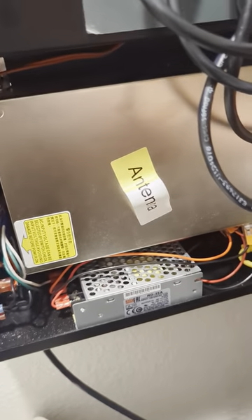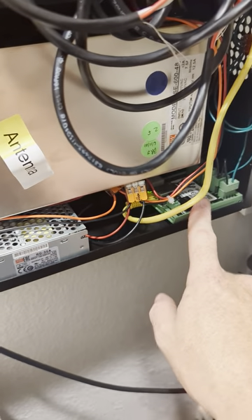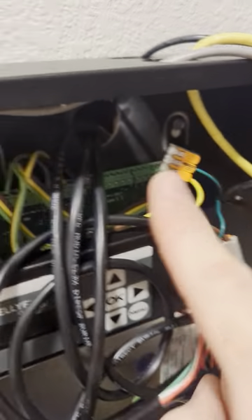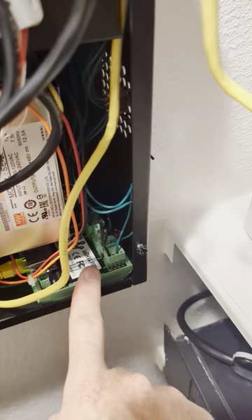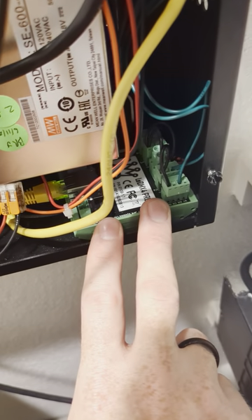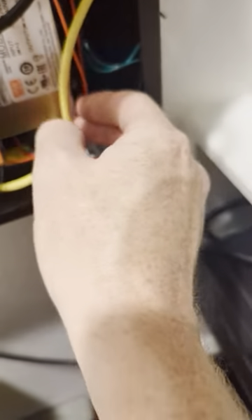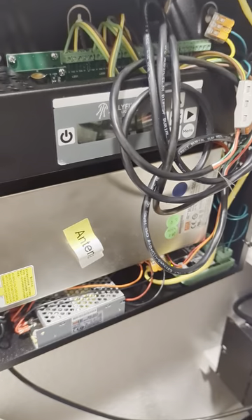So that is how I've done it — I hope that answers your questions. Recap: there's your 48-volt power supply, and your 5-volt and 12-volt power supply which powers both my third-party device and the Jellyfish controller. From the Jellyfish controller we have the I/O board, which is intercepted by a toggle switch that selects the data line between Jellyfish and the third-party controller. I went with a professional purpose-built device because I didn't want to spend time troubleshooting Arduino or Raspberry Pi custom setups — I just wanted something that worked, and I've been very happy with it. It handles the length of the run just fine. I hope everybody finds this useful. Cheers.